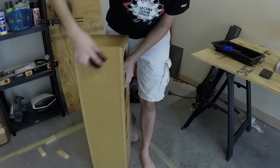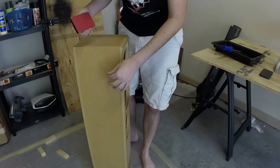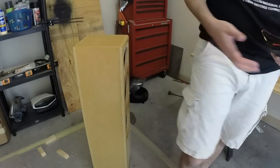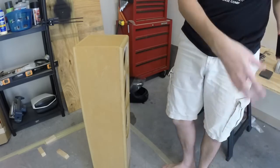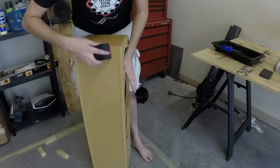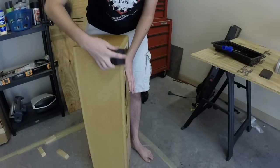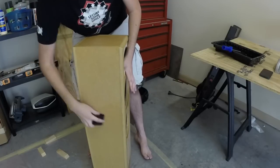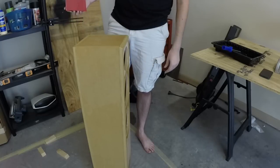just go back and forth, and what you'll notice start to appear is this white, almost like a pasty looking cover on top, and if you feel it, it feels very similar to wood glue. That's essentially because what we're doing is abrading off that top layer of wood glue and mixing it with water to turn it into like a slurry. And when it dries, that slurry will bind to the wood glue underneath it. And it will give us a very nice and even coating that's like no difference whatsoever between the two neighboring pieces of wood, which is what we want.